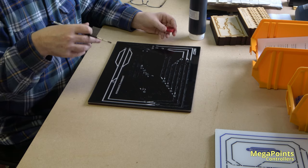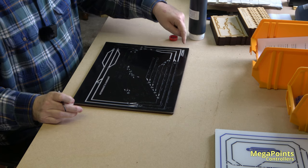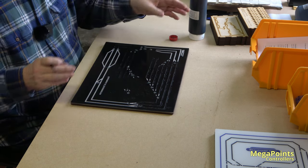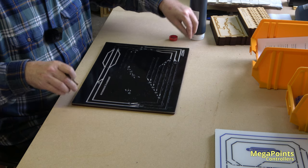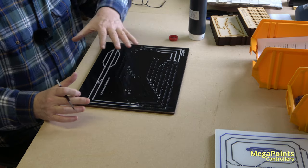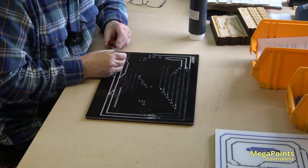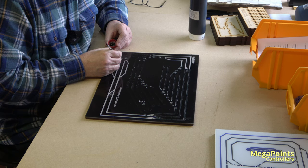And the top camera it uses to locate the fiducials on the board. So if this was a circuit board, what you'll see is that there's a little circle here and here that aren't attached to anything. They're called fiducial marks. And the camera will go to that and measure it and measure this, because every board, when it's placed on the machine, is in a slightly different position. So if it's at an angle or whatever, it'll pick up those two fiducials and calculate the offset, so it can then adjust the placement of every part based on what the camera measures. And when I turned it on early December, there was no video output. So, instant crisis.